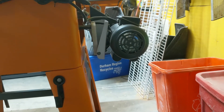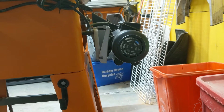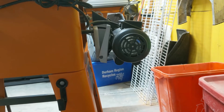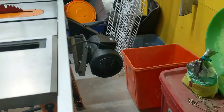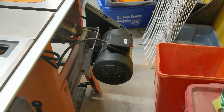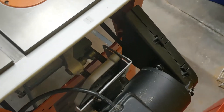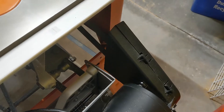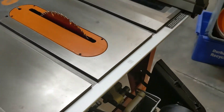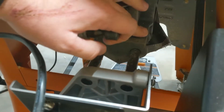One of the big advantages of the outboard motor is better cooling — it's belt-driven, so any issues and you can change the belt. If there's any lock-up on the blade, the belt slips rather than locking up the motor, causing it to overheat and blow up bearings. It's a self-tensioning belt: the weight of the motor is what keeps the tension. Simply loosen these two nuts and you can adjust that tension if you ever need to.